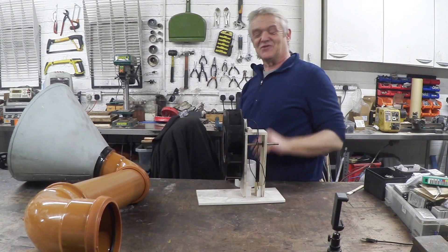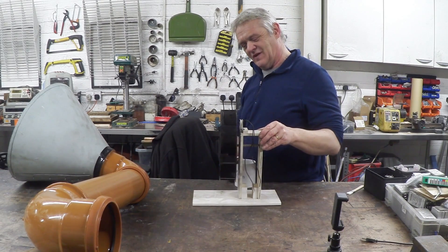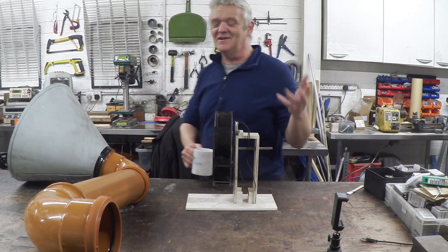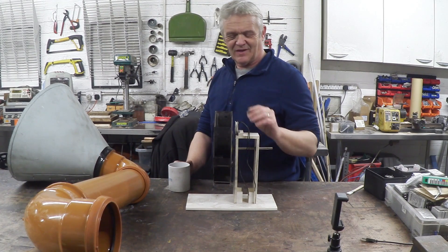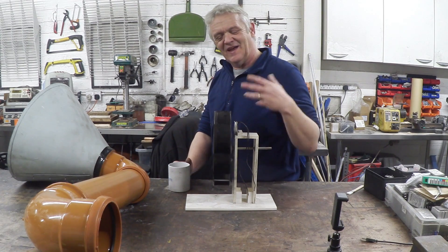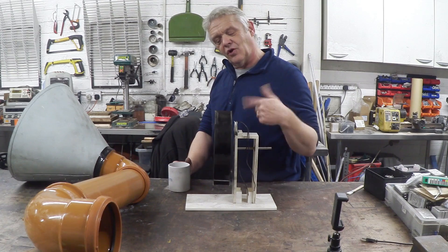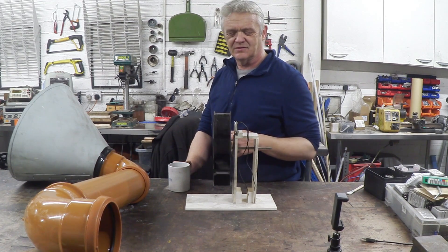I personally thought that was awesome. What you get a lot of the time from people is: 'that's a lot of effort for not very much power.' For those people, this is a roughly made thing. If we look at the distance between the coil here and the magnet, it's about a centimetre — so there's not much force being applied to this coil. The coil is a multi-turn coil from a microwave oven, so we get quite a high voltage out of it.